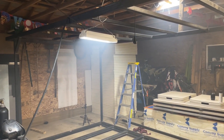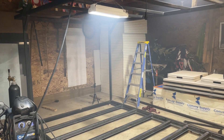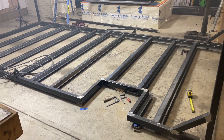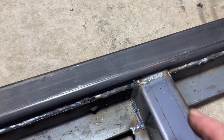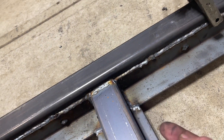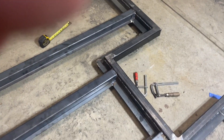You can see how foggy it is — I welded almost four or five hours. As you can see, the floor joists are in and completely welded. The weld goes around, down forward, and closes that notch so no splash water can go through — not everywhere, on each end.